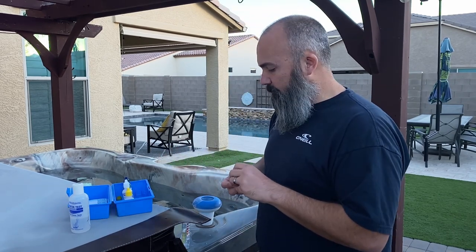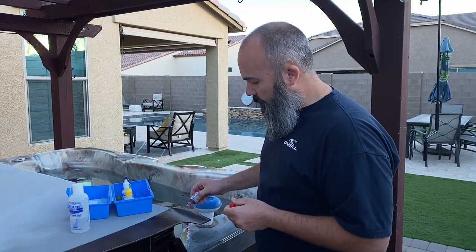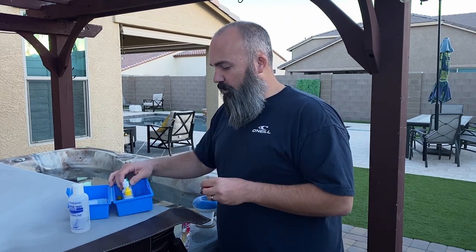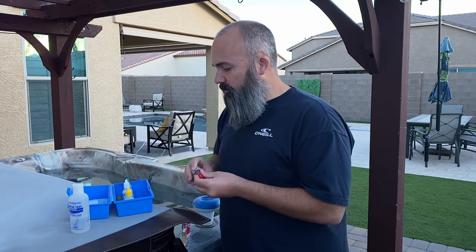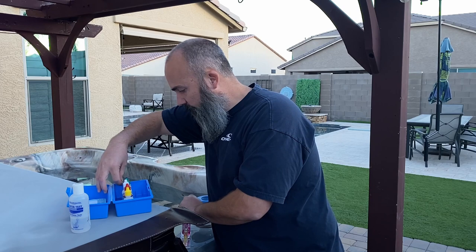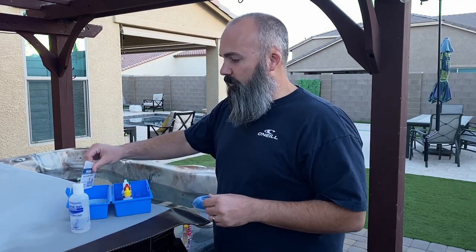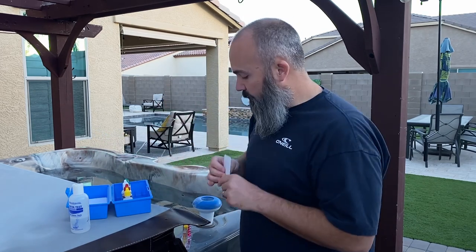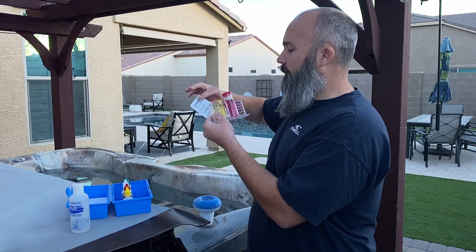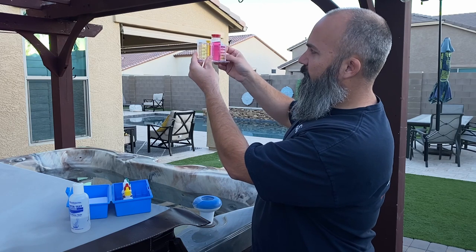So 5 drops for chlorine and 5 drops for our acidity. In the acidity check, you put 1 drop of chlorine neutralizer in there so that you're just checking the acidity level. Then they provide you with this little white backer so that you can read your color. Give it a little mix. Throw the backer on there. Test both ways if you need to.